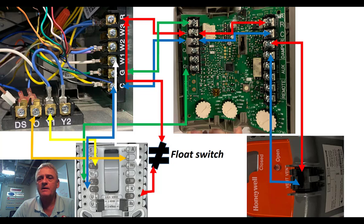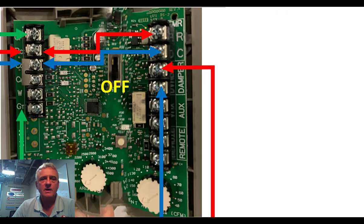We have our damper wiring again — a little better picture of the wiring in the fresh air board. Take notice to something here: see the W terminal coming out of the left-hand side of this slide? That W terminal is intended to take a signal from the electric heat from the thermostat, and in turn say, well, that's also a call for a blower. This board will interpret that as a call for blower and take it into its math of figuring run time.